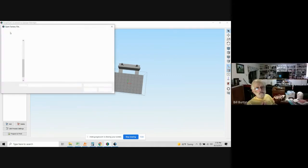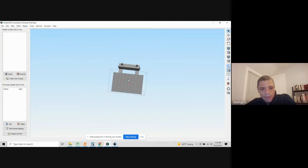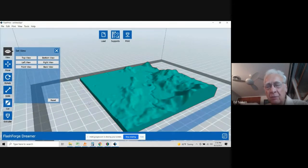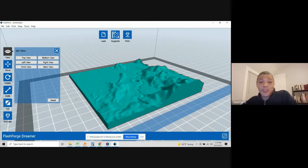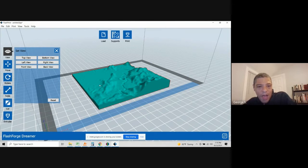This software came with my printer. You can also download free slicers — programs that you can use. STL files work with any slicing software, free or paid. You scale the model down to the size you need for your printer. Printer settings depend on what you want the object to look like. You may get better quality with a slower setting and thinner layer heights. Layer height can go below 0.1 millimeters, though eventually you run out of resolution. Print speed is important for accuracy as well.